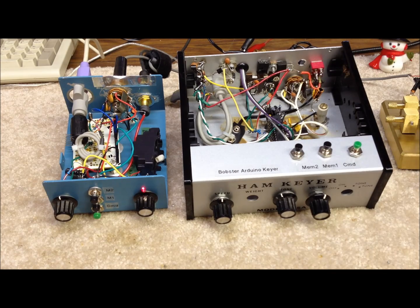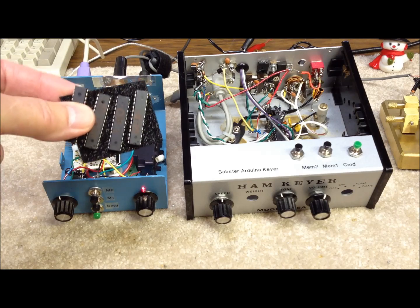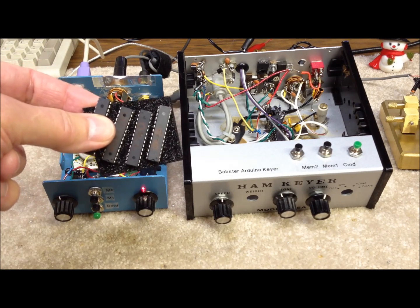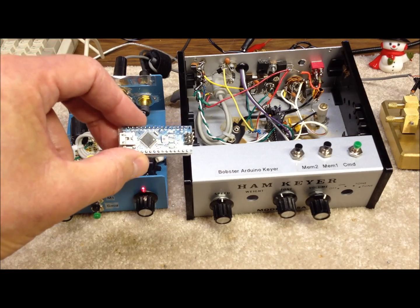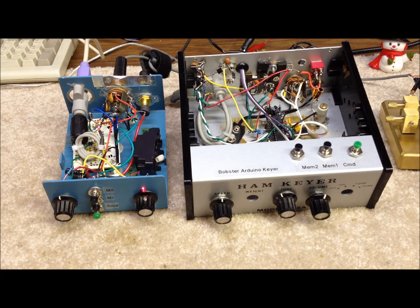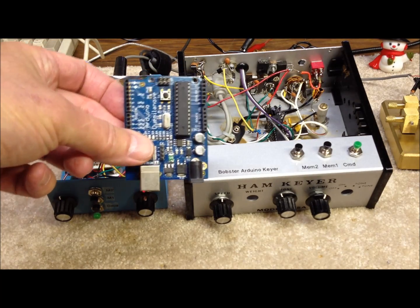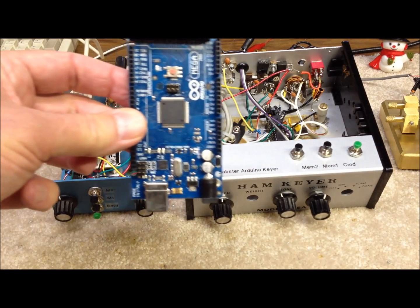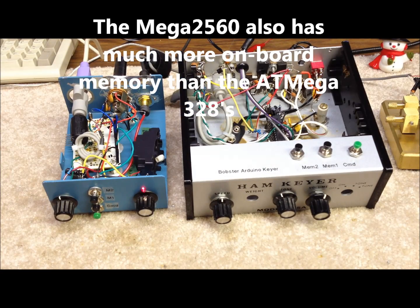As long as the boot loader is installed in the processor, that's all you need. We have several processor options here: the bare AT Mega 328 can be used by itself mounted dead bug style upside down. There's also an Arduino Nano, available online for about $12 to $13, with access to the digital and analog pins. This is one of the original Arduino AT Mega 328s, still available online in the $12 to $15 range. And this is the latest Arduino Mega 2560 — physically a little bigger with a lot more I/O pins available. Any of these could be mounted in the chassis.